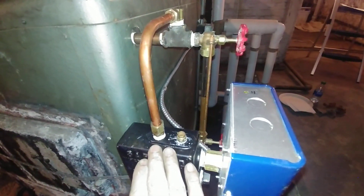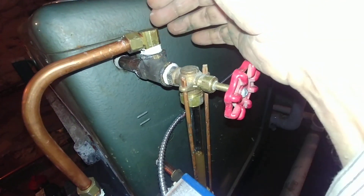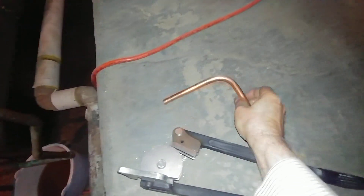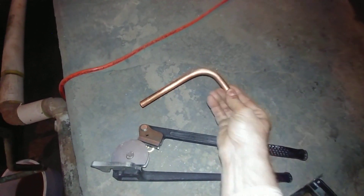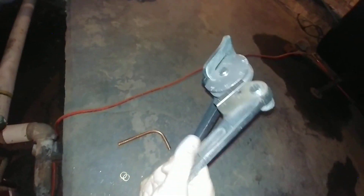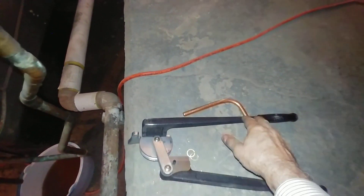You can attach it on either side, as we've done here. This is a compression fitting, again very much like the 67. I make a slight modification here with a half-inch by half-inch compression fitting with a 90-degree elbow to allow for greater adjustments. We make our own bends with half-inch outside diameter soft copper using a pipe bending tool to provide good kink-free bends.